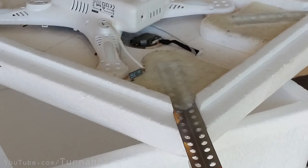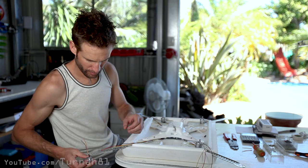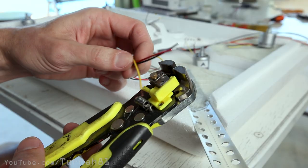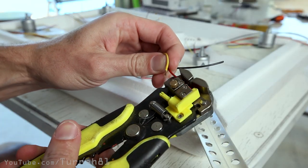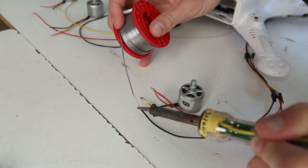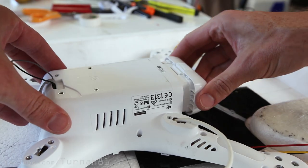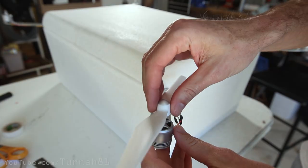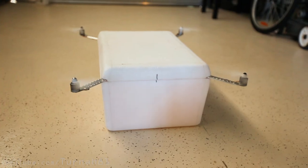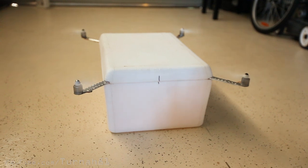I put all the guts of the drone in place and then extended the wires out for the motors. Soldering the wires on the Phantoms is actually pretty hard because everything is heavily lacquered — it's hard to get the lacquer off and hard to solder. With all the wiring and internals in place, it was time to test it out. I chucked the battery in, powered it up, and it didn't catch on fire, which was a good thing. With the props on it actually has this cool sound when you fire it up because the box resonates with the motors and makes this cool car sort of sound.